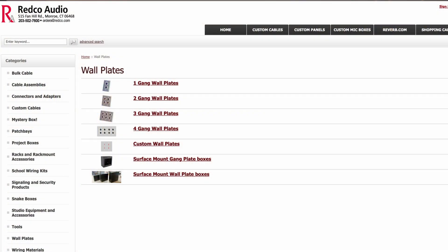There's a great resource called Redco — they build custom panel boxes for recording studios and you can get a custom-made box specifically for your needs: four XLR inputs, XLR outputs, TRS cables, HDMI, ethernet, and power outlets all in a single wall box in your acoustic wall, with a single snake for audio and single electrical for outlets. This makes a really clean and professional look, and you get everything you need for your vocal booth right there without running things through the doors. This is what I recommend for my clients and it's the best way to do it.